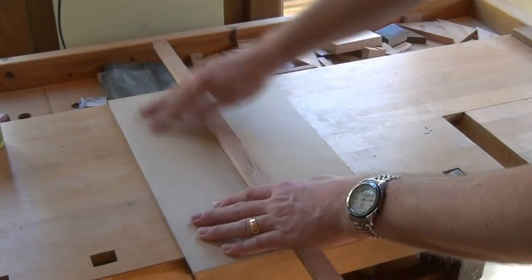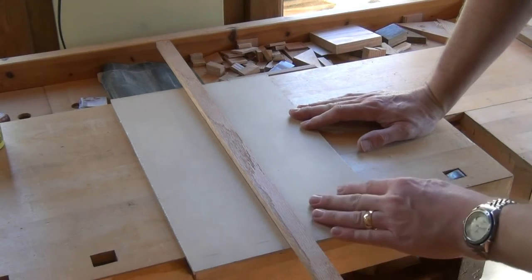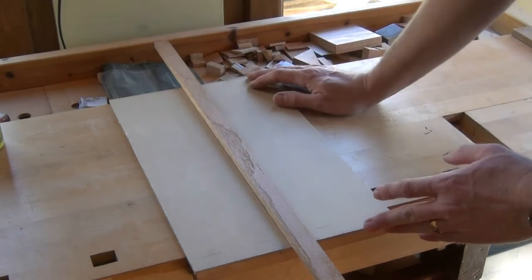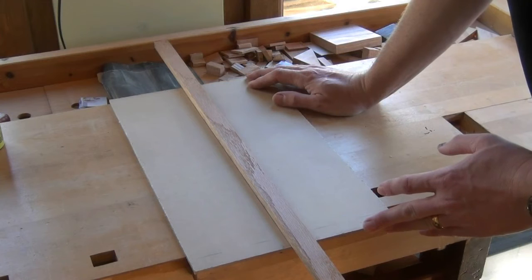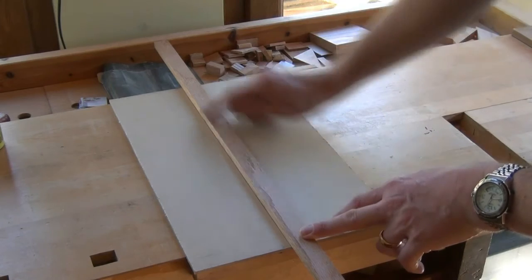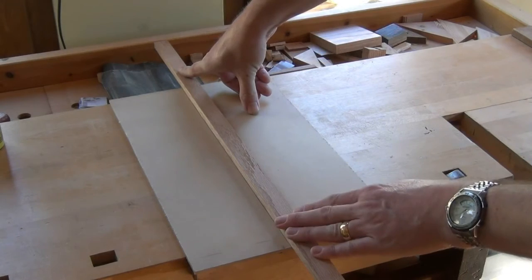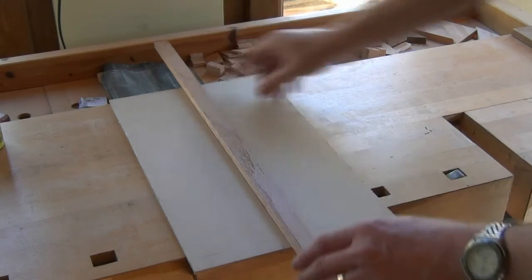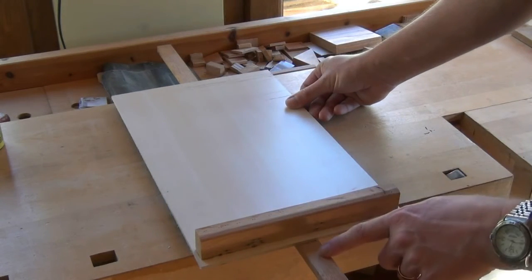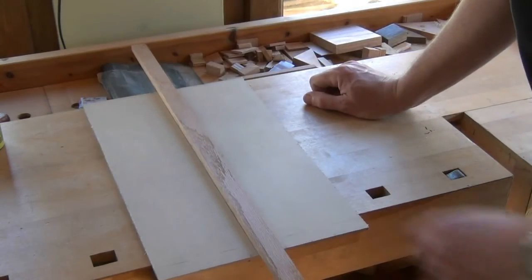I started with a sheet of MDF, a little bit over twice the width of my circular saw base. I've cut this one — it's roughly 15 inches long — which gives me the scope to cross cut easily over a foot. I've attached down the middle a straight oak fence to rest the side of the circular saw against, and underneath I've glued on a fence at 90 degrees so we can easily line up for a 90 degree cut if that's what we want.